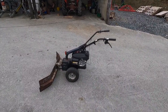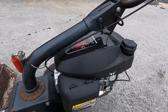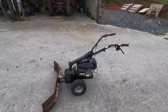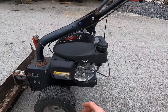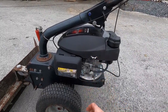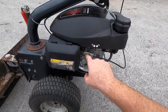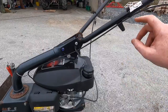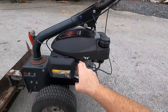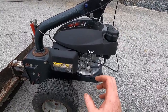It's different in good ways compared to the last one. One of the big problems I had was the throttle on the last one - it was a very peculiar, badly thought-out setup. There was a 10mm nut attached to hold the cable in place, and that nut was rubbing back and forth causing things to break. Even the steel one I put on had its cap break off, there was such tension trying to get it to move back and forth. Now it's changed - a simple little change has made a world of difference. It's also different on the exhaust side - the other engine used to split across there, that's all different now.